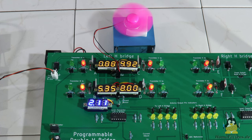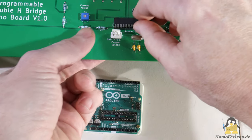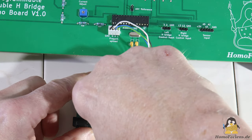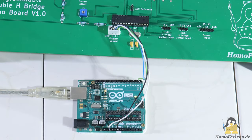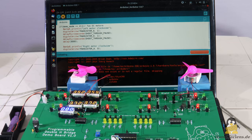A current only flows through the sensor whenever the motor is switched on. I implemented these and some more changes in version 1.1 of the PCB, so if you want to make a copy of the demo board, it is easier for you to do so. It is a freely programmable motor driver based on an ATmega328P. I took this from my Arduino Uno and put it on the socket of the board. So that the microcontroller can still be programmed via the Uno board without having to swap the chip, I joined pin 0, 1, reset, and ground with a 4-pin connector. If these pins are connected to the Uno board, the microcontroller can be programmed and data can be exchanged via the USB interface.